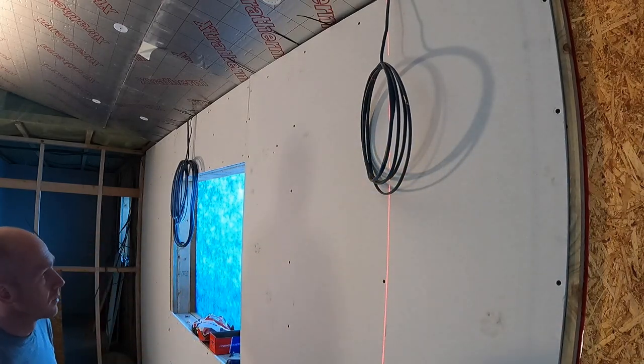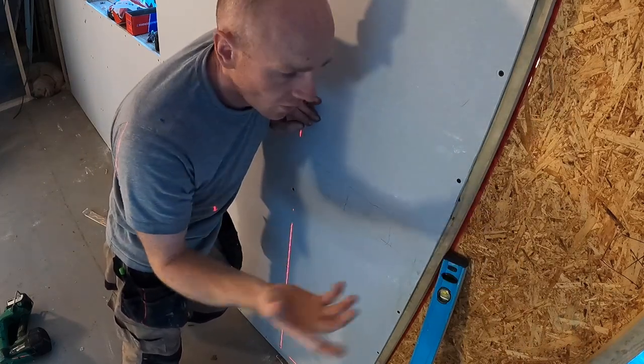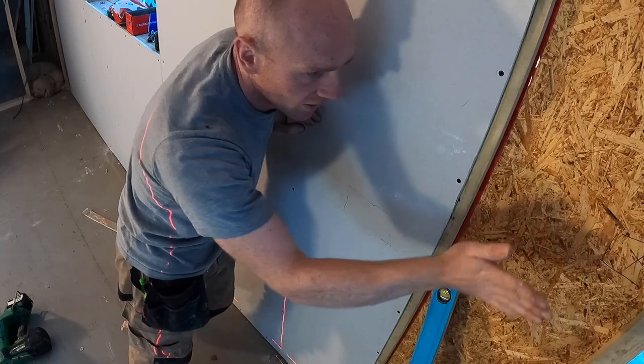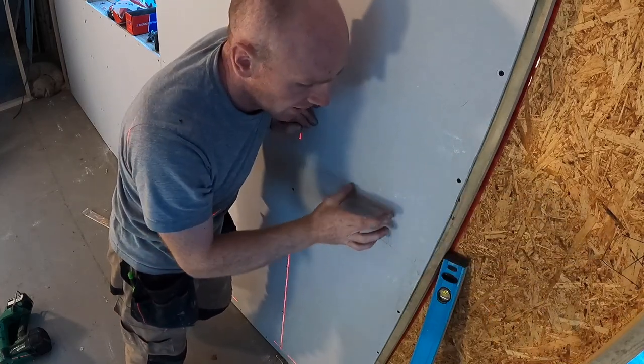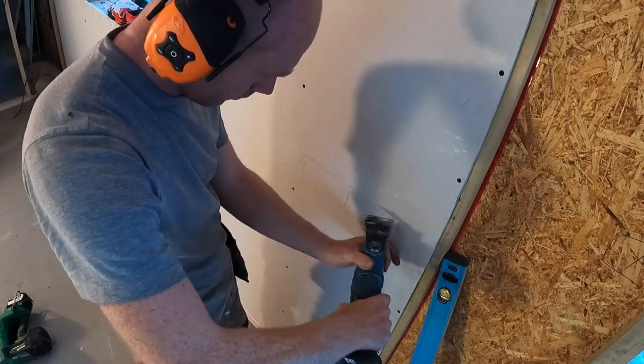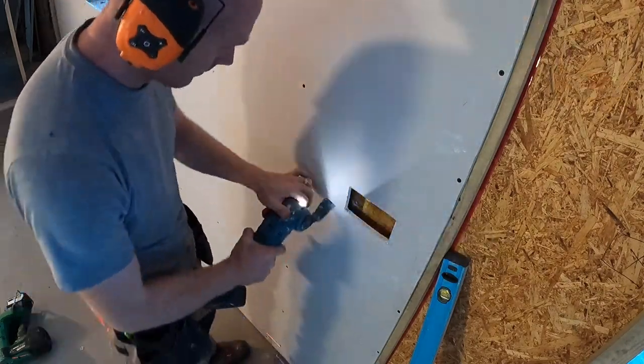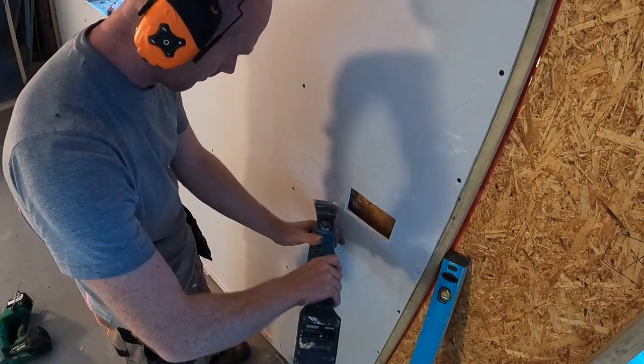We're actually using metal boxes on the walls which have got OSB on them, because they're 25mm deep we can fix them to the OSB and then cut out the holes. I haven't got any metal boxes here but they're on the sides, so I've marked up these two. I'm going to cut them out, pop the cables through, and then we can fit them afterwards.